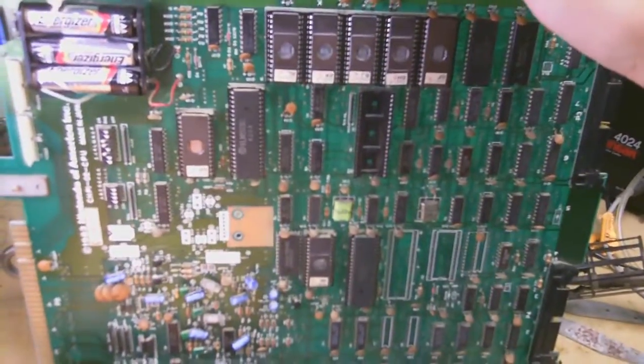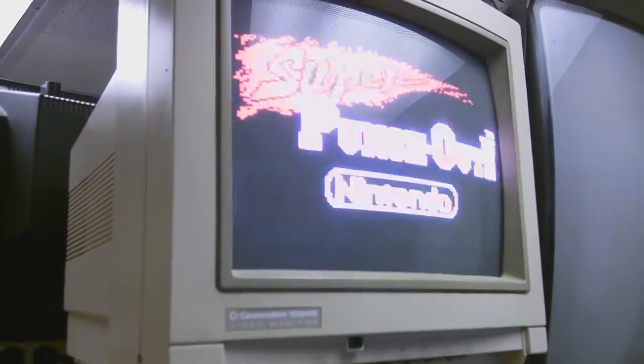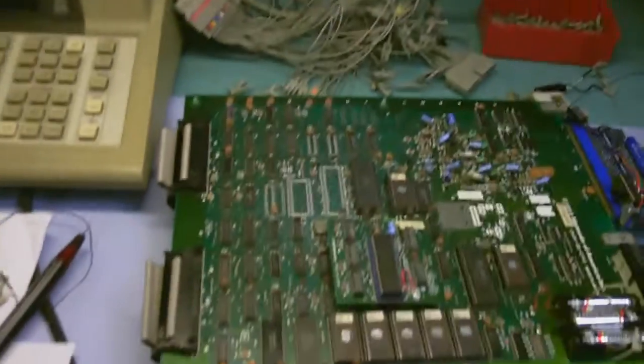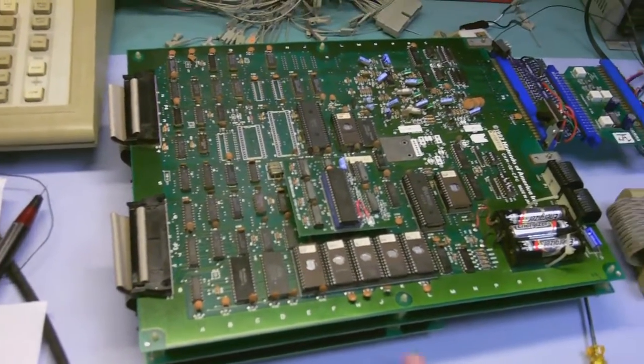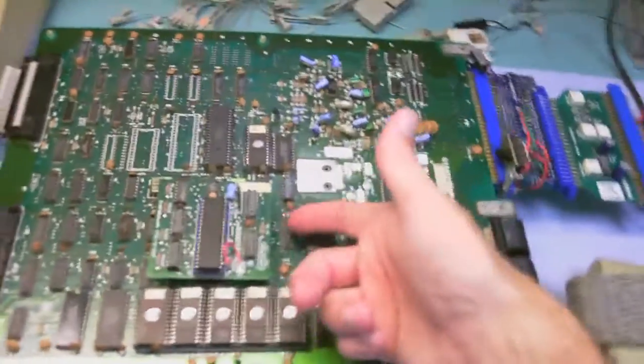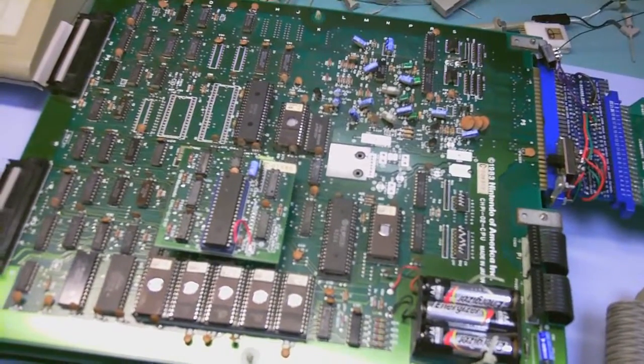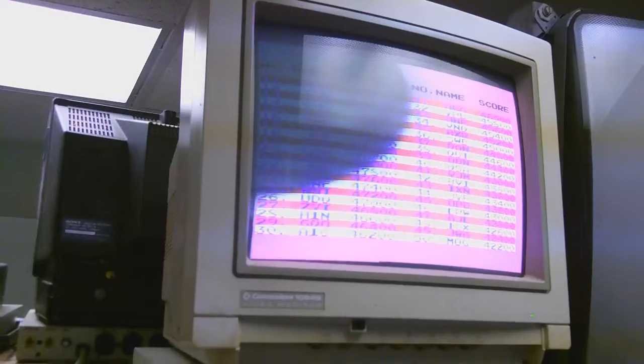Let's fire it back up and throw the board back in the stack. You can't really see it but this is the guy we replaced right there. This is an actual board I'm fixing for a customer. And there we go — that's what we want to see. Gorgeous. So yeah, that's it. The tips to take away from this are: take your time, definitely use flux — don't even attempt to do something like this without flux — and don't try to salvage the ICs, just snip them off and get rid of them. Otherwise you'll end up ripping up traces and cursing and probably selling your board as parts on eBay. Hopefully you found this useful and we'll catch you on the next one.